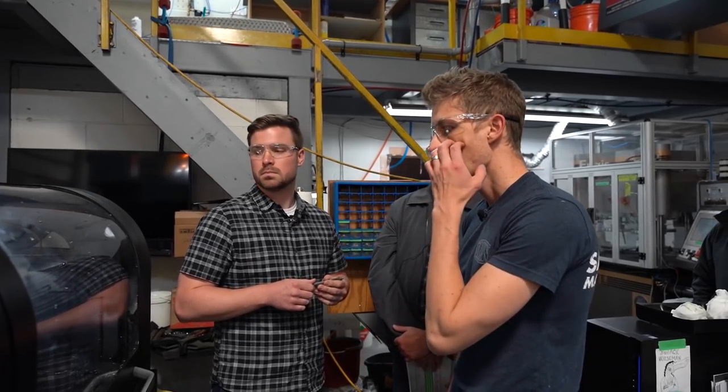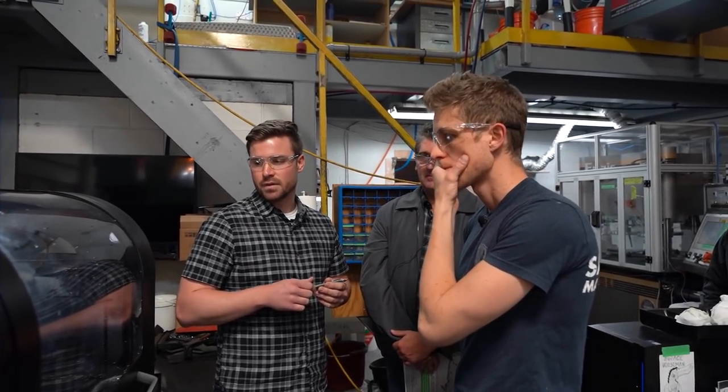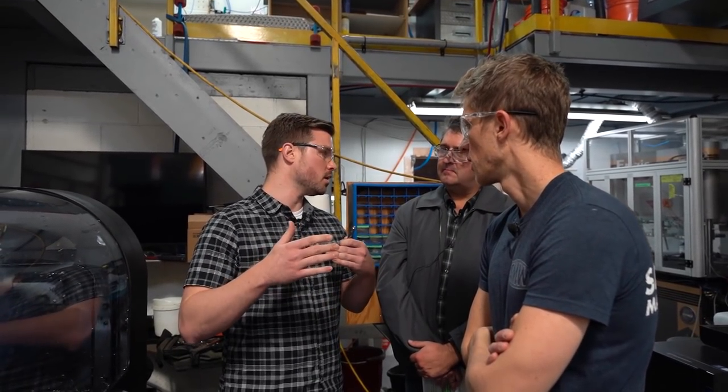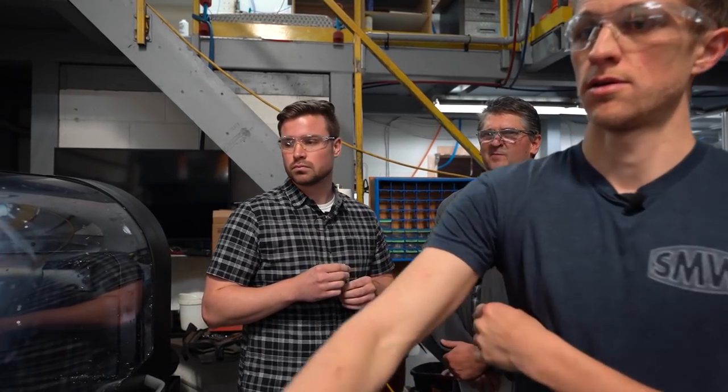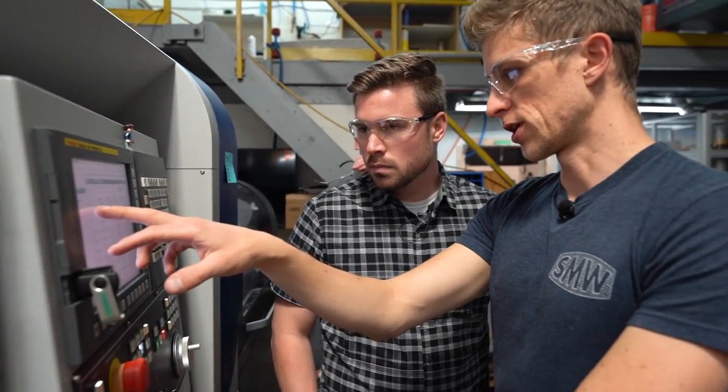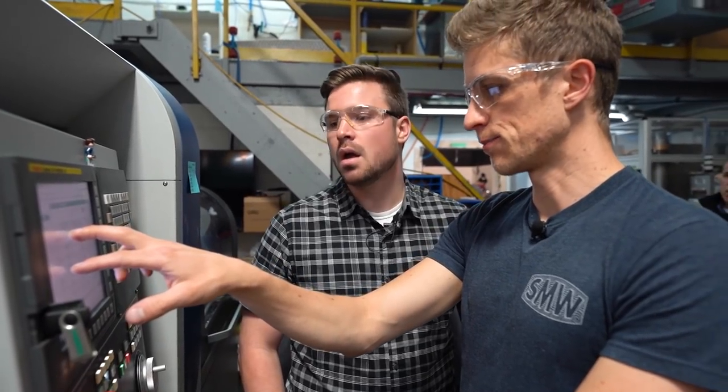Yep. Okay. And say you're running high volume, are there options to have cycle count or automatic tool changes? Oh, yeah. Yes, there is. For your tool life management? Yeah, absolutely. I'll show it to you here. So here for tool life, I've got tool 120 is my main turning tool. It's made 698 parts.